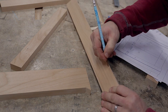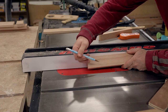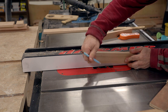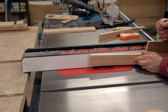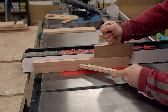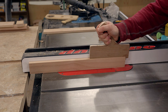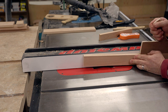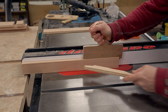I mark the stopped groove location on both sides of the wood — this is where I want to cut to. I line up some reference lines on the table saw that indicate the starting and ending location of the saw blade for a dado cut. I turn the blade on, drop it down onto the saw really slowly and carefully, and use push sticks to push it until my lines line up with the stop line. Then I stop the table saw with my hip, wait until the blade completely stops, and remove the piece. I flip the piece over and repeat so my groove is exactly on center, and I do test cuts so the plywood fits nicely in the groove.